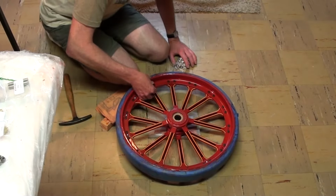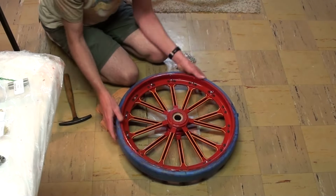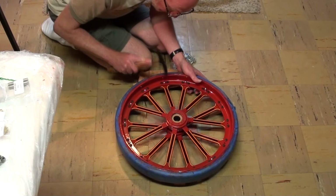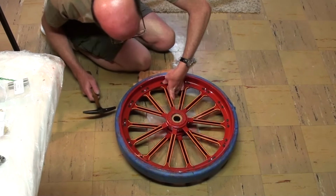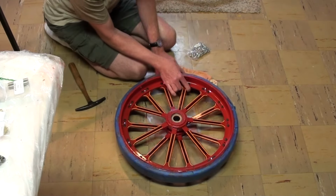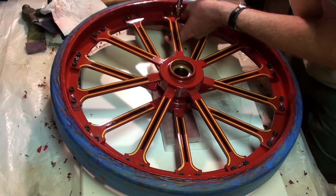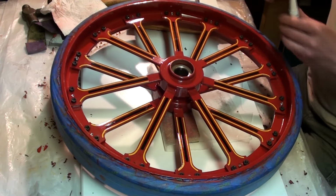Once all the center bolts and nuts were placed, the outer spoke bolts were replaced one at a time with rivet bolts. One bolt was replaced in each spoke all around, then the process repeated for the remaining bolts. It is important to note the correct placement of the rivet bolt and nuts. The rivet bolts are inserted from the outer surface of the wheel rim, then through the spokes. The nuts are tightened against the spokes. This too is carefully diagrammed in the instructions.